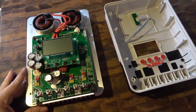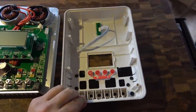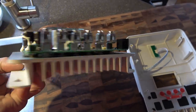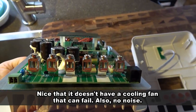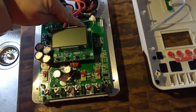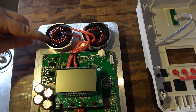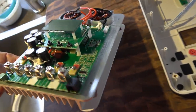Just before installing it, I thought I'd give you a peek inside. I don't recommend doing this, but it was pretty easy — just four screws and the front plastic cover comes off. Overall it looks pretty good. It's all mounted on a heavy-duty aluminum heat sink, with all the transistors and FETs mounted underneath onto it. The connecting ports look like they could fit a six-gauge wire. The board has been conformal coated, which is nice, and the capacitors are rated at 105 degrees Celsius. They've also mounted the coils in epoxy right onto the heat sink. Overall the build quality doesn't look too bad.